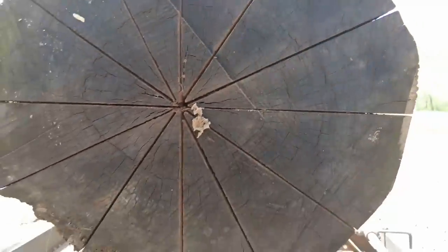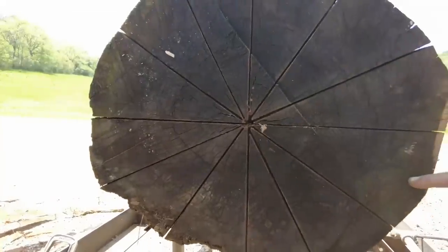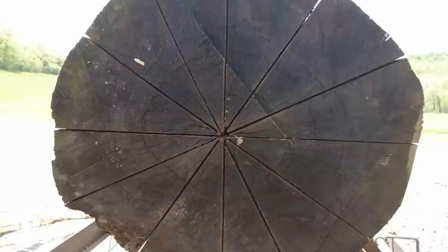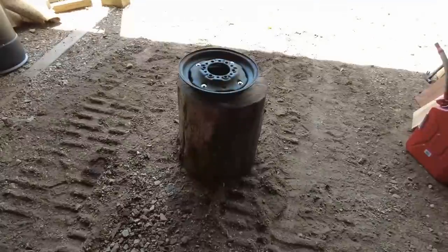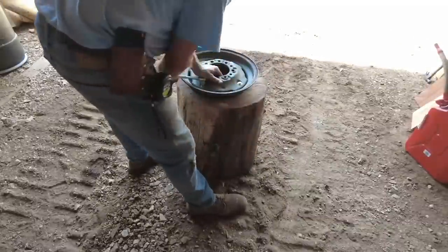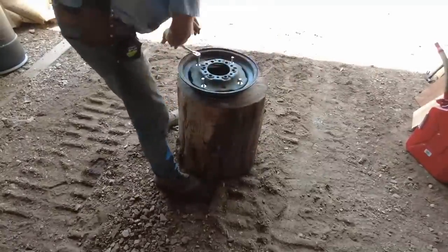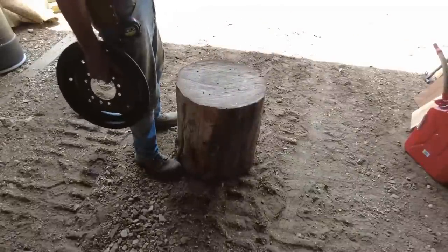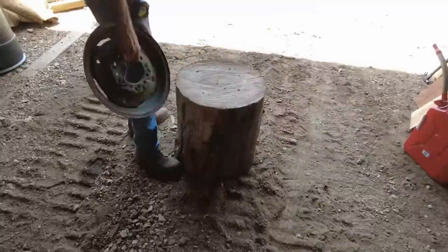There's got to be a learning curve the first time you do anything, and overall I'm pretty happy with that. Let me show you what the saw cuts look like. Here's a close-up of what the saw cuts look like — hopefully the camera's getting that. It looks pretty good overall. Pretty happy with it. There's a learning curve anytime you do something. Now each one of these can easily be split one more time and probably two more times and still get a pair of bookmatched backs. Right now I don't think I'm going to do that on the sawmill — I think I'm just going to call this my test log and leave it like it is. The lug bolts held really well. I didn't feel like there was any slippage anywhere in this whole process. So overall, very successful.